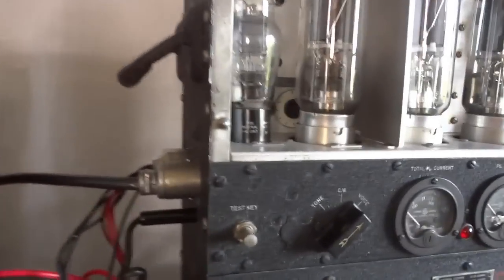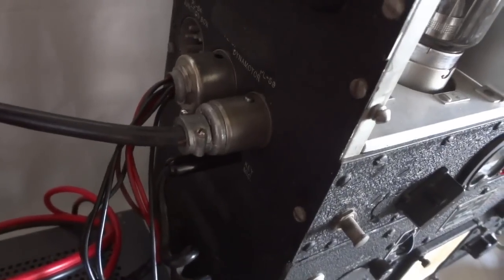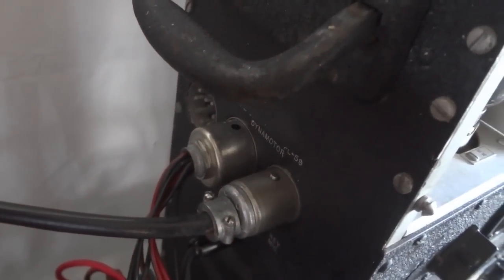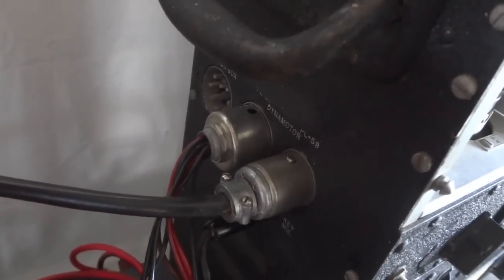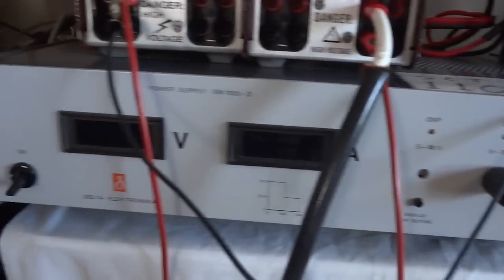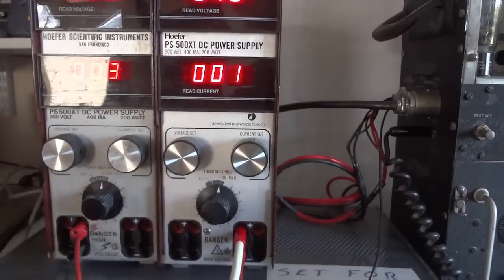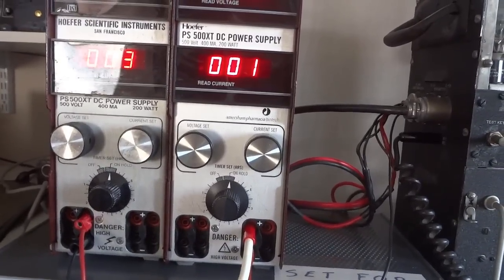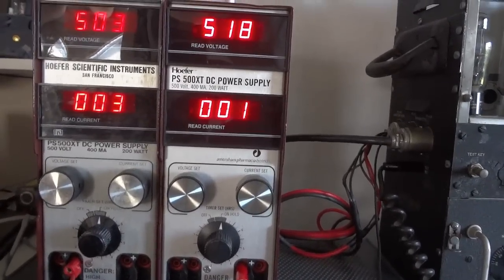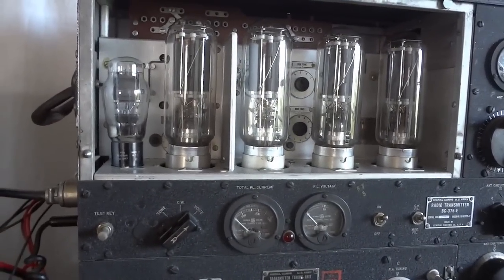Here you can see what is actually hooked up in terms of power. The HT uses a single-pin connector with thick insulated cable; this cable goes to the ground — the negative voltage. For the filament voltage we use a DC power supply, and for the HT a thousand volts is needed. I have two PS500XT electrophoresis power supplies in series that together give me a thousand volts, and they are regulated, which makes the modulation much better than with the original dynamotor setup.